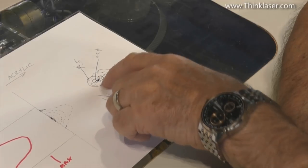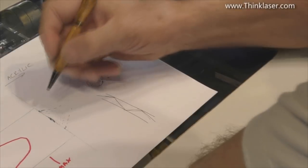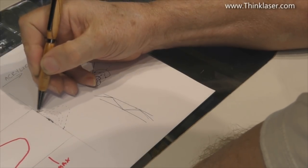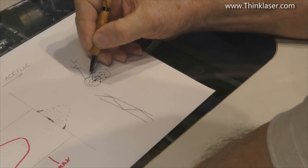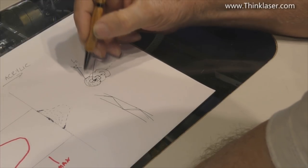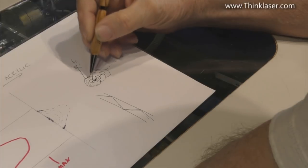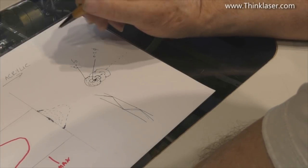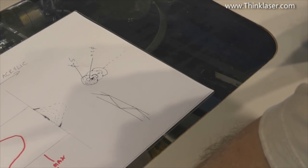These little nodes may be exaggerated, or they may be a combination of these patterns and the pulsing of the laser beam or the frequency of the stepper motor. We may get some rather strange and random patterns, but the underlying striations are produced by this mechanism. So how do we get rid of these striations on a cut? The answer is actually quite simple: we allow enough time for heat to build up on the edge of the cut, and that heat means we get a liquid film which naturally wants to smooth out and take away the peaks. But it depends on heat being retained in the cut - if you cut too fast you will probably create striations.